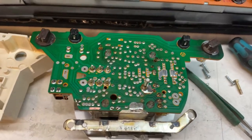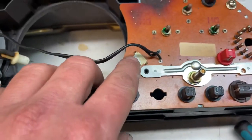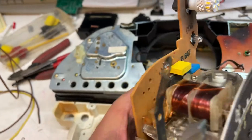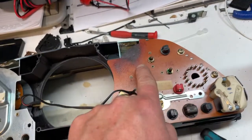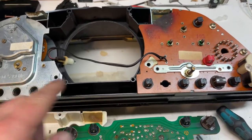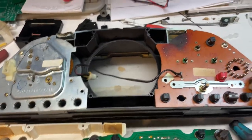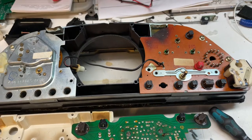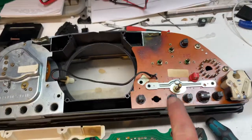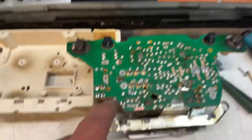If you lose ground from either side — without having this taken apart like I did and shorted — that means this part to here doesn't make any contact anymore. What you can do is get one of these little tiny spring washers and put them in between here, and when it's assembled on the bottom side, they will make contact again. Or you could run a wire from here over there — depends on which side has better contact. Either one can lose it; if this side goes erratic with no more connection to ground, that's basically what the star configuration was designed to prevent for noise protection. If it's completely going haywire and you have no connection from this bar to pins four and six, then you have a blown track.